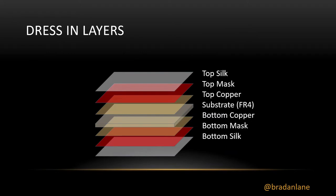The difference between acrylics, where you have an infinite palette of colors, and a printed circuit board is that you have a limited number of colors, and each one has to fit onto a layer. The top-most and bottom-most layers are the silk layers. Then there's a mask layer, which is typically a solid color. Traditional PCBs were green, but thankfully we're not limited to green anymore. Most PCB companies now do green, blue, red, yellow, black, white, and we're starting to see more pink and a nice-looking purple.